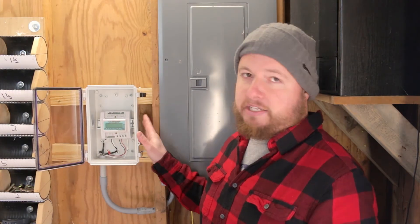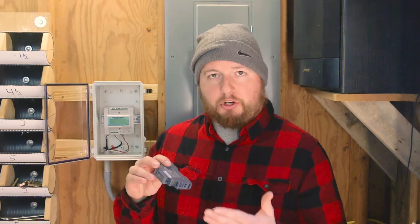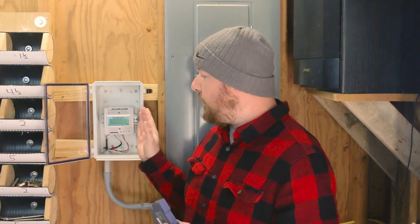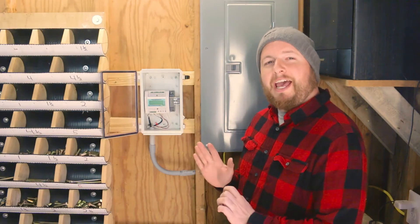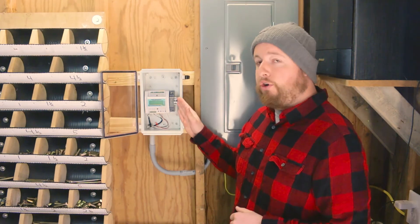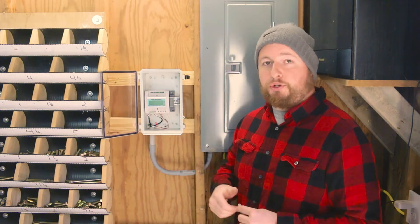However, we need an outlet right next to our Omnimeter, and I don't have one. So we're going to use our third option: this power supply right here. It's going to take in 120 volts AC and convert that into 12 volts DC to power the antenna. What's really nice about this power supply is that it fits right onto our DIN rail here next to our Omnimeter. I went ahead and put our power supply in our enclosure and moved everything to the left-hand side. We still need room on the right for our antenna. The next thing we're going to do is hook this power supply up using lever nuts — I'll bring you in a little closer and show you how to wire everything up.